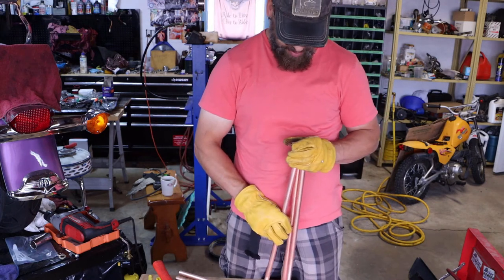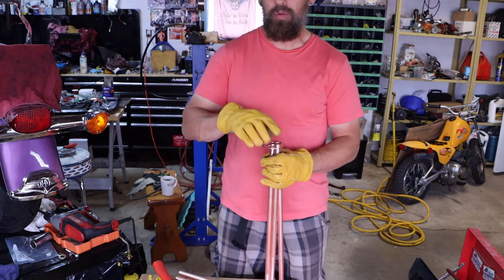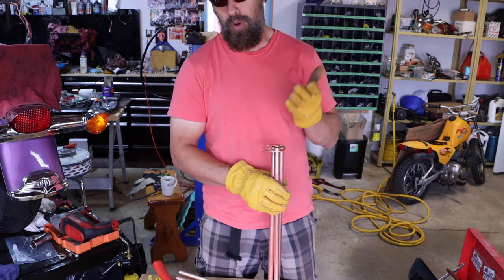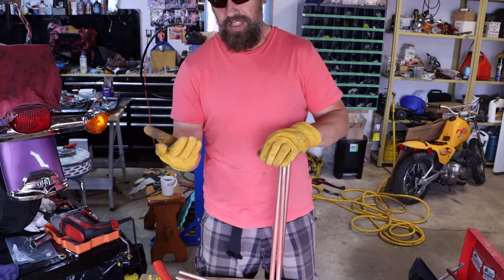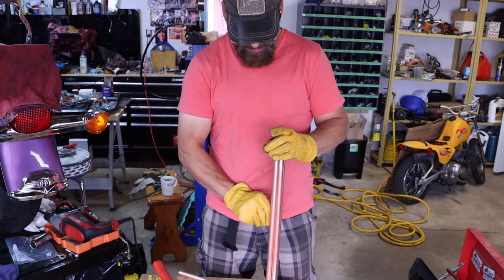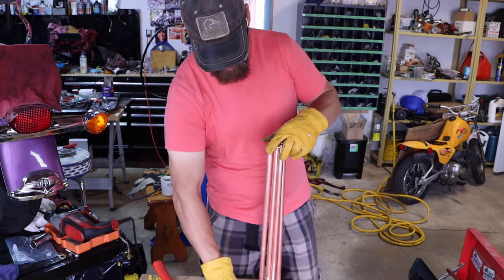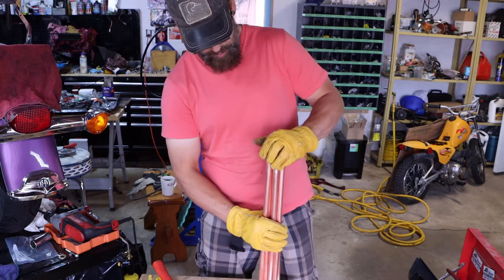You know what I thought of while I was doing this? I thought of having these stick out a fair way. And then I thought, well, if I do that, it kind of defeats the purpose, since it's supposed to be for cooling, right? The more pipe you have exposed past that ring, the less of it is going to be cooled by the water. So I changed my mind. I'm going to try and get this as close as possible. Well, that looks pretty tickety-boo there.